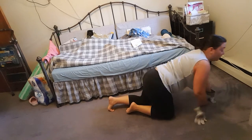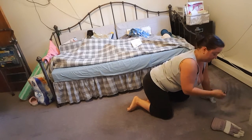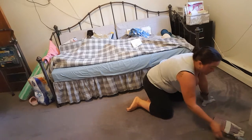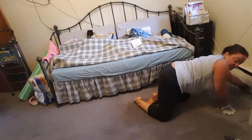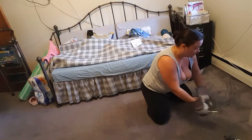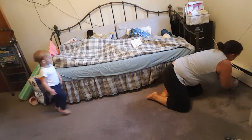The hardest part is going to be getting the carpet out from under the heater — no joke, that's actually the most difficult part of this whole thing. Take the glove off, get the knife out just in case. Remember there's going to be a tack strip underneath, so have a hammer and needle nose pliers handy, because getting it out can be a little difficult at first.